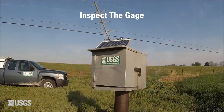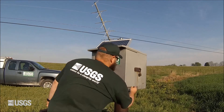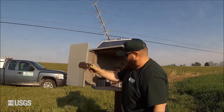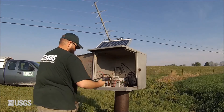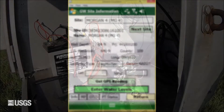Inspect the gauge. Read the station description for the driving directions, site-specific safety requirements, and become familiar with the gauge and equipment. Read the well log, including the casing screen information, the depth of water, temperature, and previous redevelopment information. Prior to redeveloping any well, you will want to complete a thorough gauge inspection.